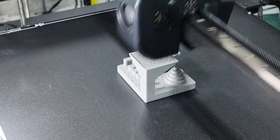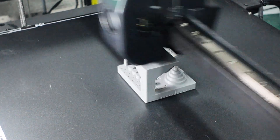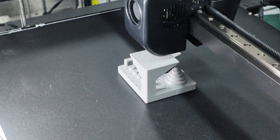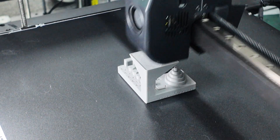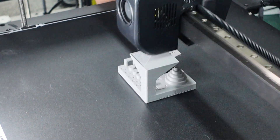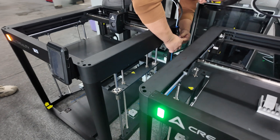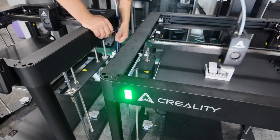I'll repeat what I said in the last video for those of you who forgot — the build plate size on this is 400 by 400 by 400. That's the build area, not the build plate size. The build plate I think is 415 by 415, but the build area is 400 by 400 by 400. It's huge. So it's got two lead screws and then four rods. The size of those prints could be quite heavy, so it's almost got four lead screws here — you can see two on each side. Yeah, it's unreal and so simple, just this frame.